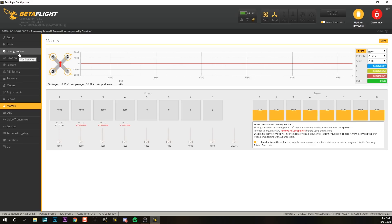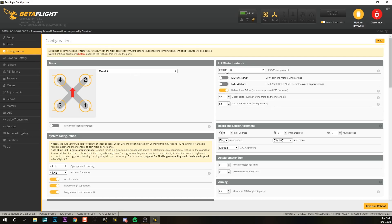If it's not staying below 1%, one thing you can do is go to the configuration tab and lower your DSHOT. If you're running DSHOT 600, take it down to 300. If you're running 300, you might take it to 150, but you really shouldn't have to do that. That's actually one of the things some people are seeing on some ESCs with Jazz Maverick firmware that they're not seeing with JESC. But Jazz Maverick costs you nothing to try, so you may as well give it a go. Now that you have bi-directional DSHOT working on your ESCs, the next thing is to set up RPM filtering and tune your filters to get the best possible flight performance — and that is a topic for another video.